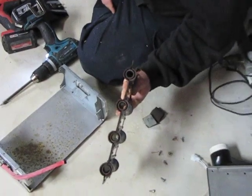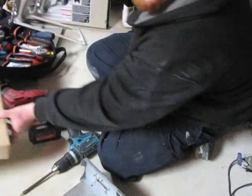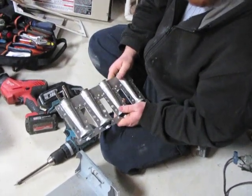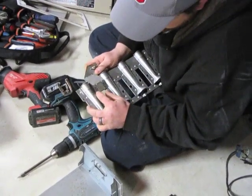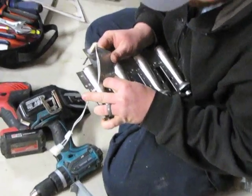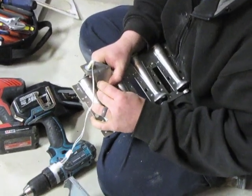These are your bad burners. Today I'm replacing them with new burners from HVAC Parts and More. Then what you're going to want to do is reassemble everything. I like to start with my hot surface igniter — reinstall the two quarter inch screws.